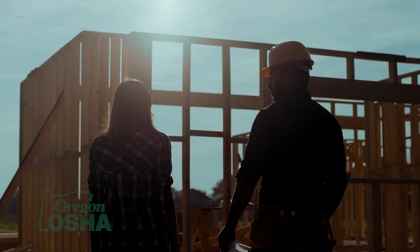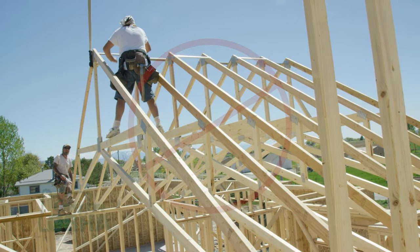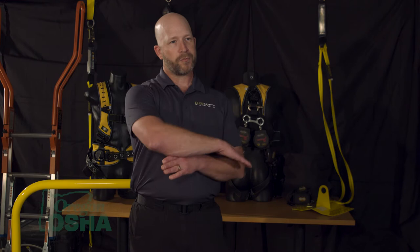The planning process is another aspect of fall protection — not just in the equipment, but in how we plan the work. Changing mindset is key. I had a conversation with a gentleman who was flying trusses in, and after we discussed, he said it would be dangerous to have a guy climb up through the latticework to the ridge to install an anchor once enough trusses were set. I completely agree — that would be highly dangerous and unacceptable.